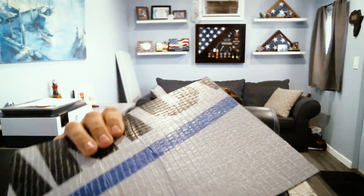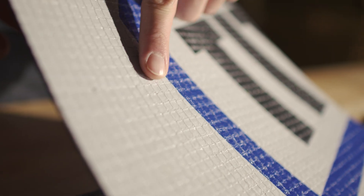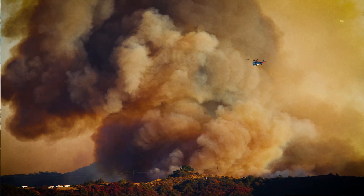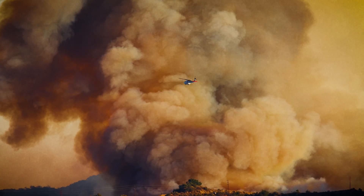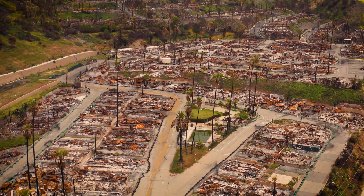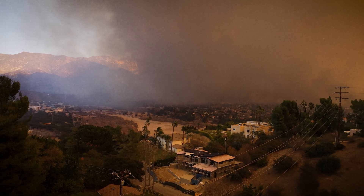This is a sample of the Titanium FR product. It is 80 mils thick, comes in a square-and-a-half roll, and has a self-adhered backing. This one has been peeled off and touched several times so it's not as sticky as it would be coming out of the roll. It has a texture on the top — they call it Sure Foot technology — to help keep you on the roof and prevent slipping. This product will bring your combustible roof assembly up to a Class A requirement.